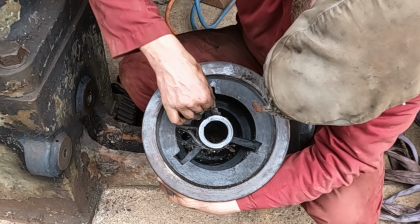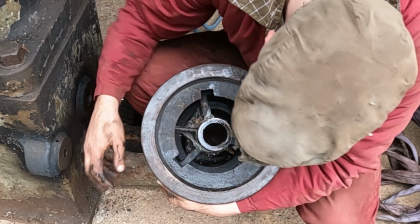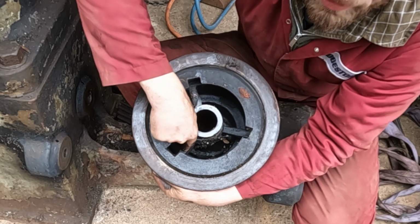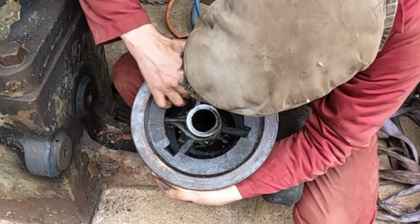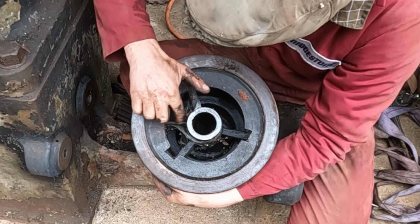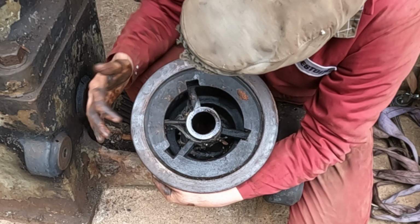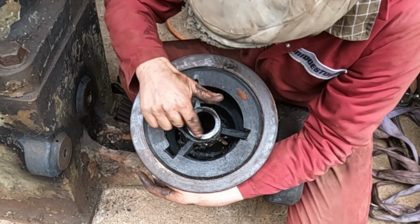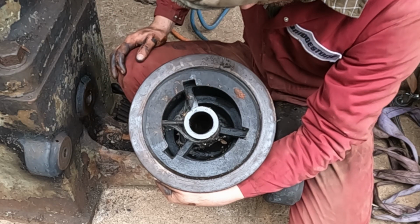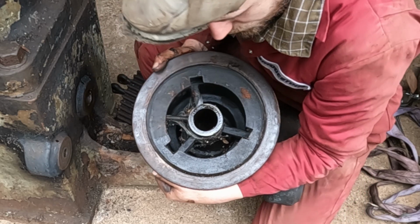There they are, some spider colonies in there. Probably Victorian ones as well. But these struts, look, you've got 3 supportive struts. That's some complicated core. And obviously the little oil pipe which comes in from the outside, which allows you to lubricate this, because when it's running in back gear, it's freewheeling on this nice oily shaft there. So, and these notches are the notches I was talking about earlier.